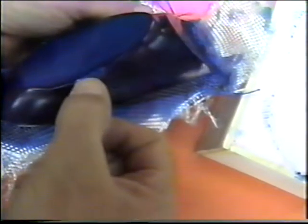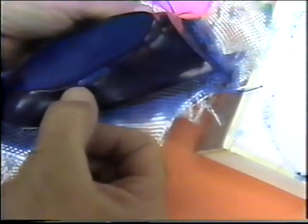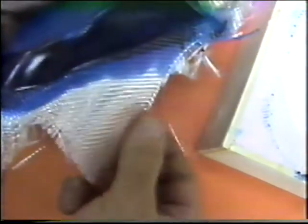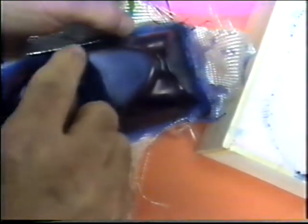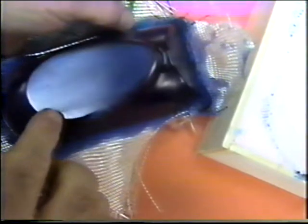So, one of the things I'm going to do now is take chop in the next one I do, and I'll do it off camera. I won't even do it on camera because it'll pretty much be the same. Take some chop, which is the little fibers that are just powdered off of the scraps, and I make a powder out of it. So it looks like, I don't know, like epoxylite, I guess. And you do put that in all the corners. I didn't even do that on this because this was just a test. Round these corners and edges, and I'll run another one of these off.